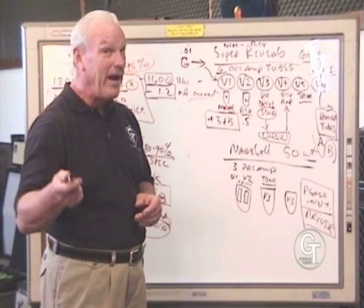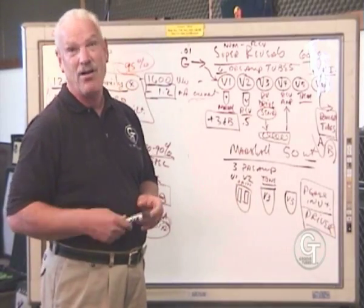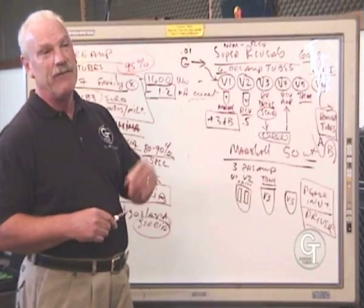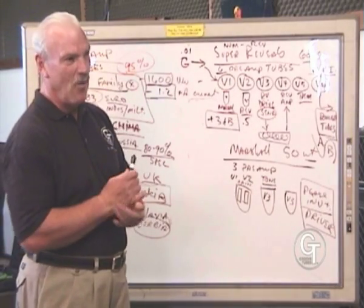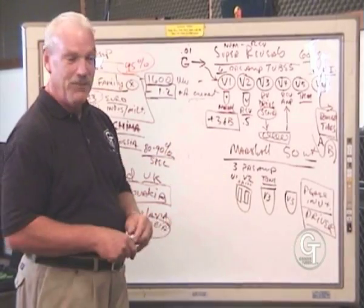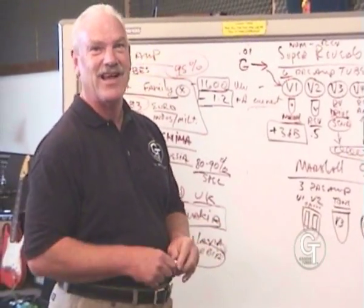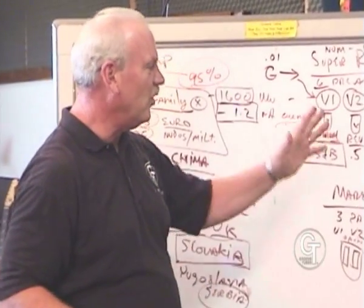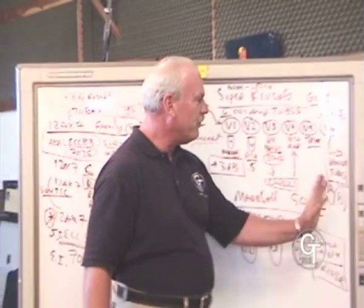Your power tubes wear out, however, it can be as often as 3 months or 3 years, depending on how hard you play. If you're playing with a lot of distortion in a band, if you're putting a 50 watt amp at full power, a 100 watt amp at half power, it's like batteries. How hard you push them is how fast they wear out. Power tubes will wear out on a regular basis, preamp tubes not. Always remember, change your phase inverter with your power section.